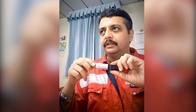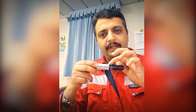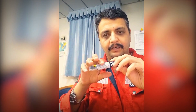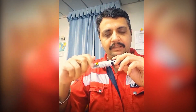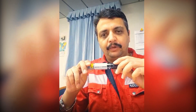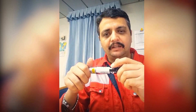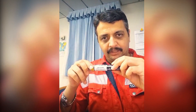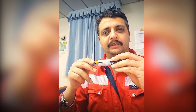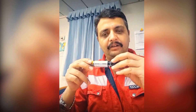So what is the purpose of this marking? After that, whenever we are doing mooring operations, we tighten the brake according to this point only — up till this point we apply and lock the brake. The purpose is that if the wire going to the shore gets more tension, tension equivalent to 268 bar of hydraulic, the winch should start loosening. The brake should stop holding and the winch should start slacking the wire. Because if more stress comes and the wire is too tight, the wire can break, get damaged, or its end can be damaged. So to prevent and save the wire, we tighten only up till this point.